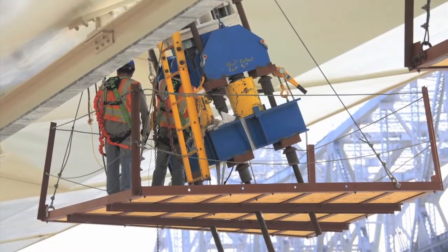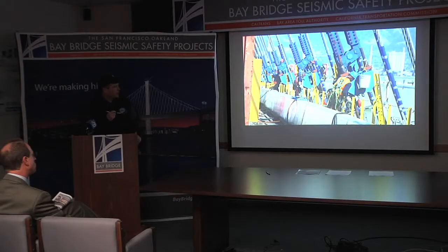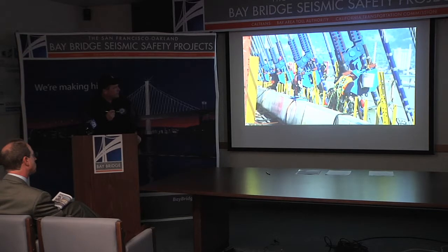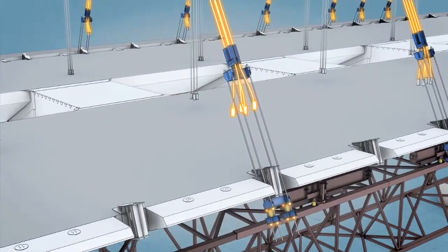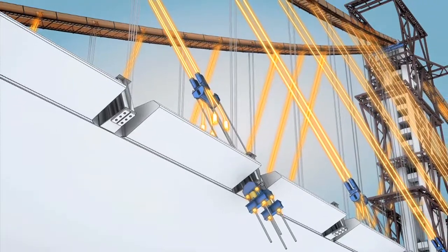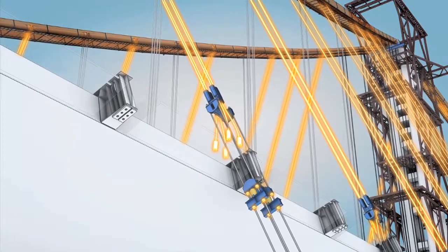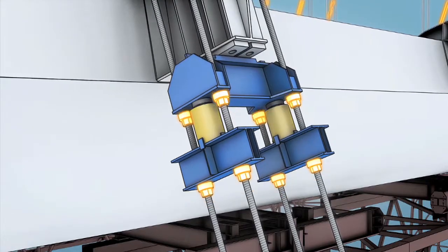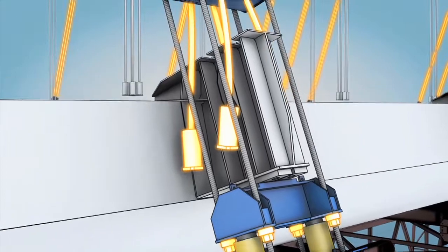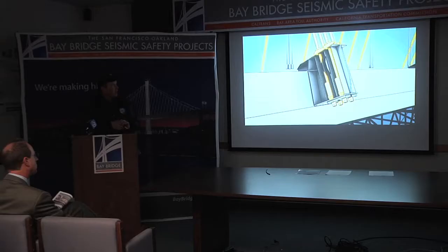Here's a little bit of what the site looked like. You can see all these platforms that were constructed above the bay, and you can see the ironworking team that was out there with our engineers at each one of these different locations. Now we're going to look at this again. The jacking unit right here is actually pulling down on the strands that are connected at this point. You can see that the cable is deforming up there as we're trying to get these pieces down into this anchor point where the suspenders actually connect onto the deck of the bridge itself. Then you can place the hardware on — nuts and bolts. You want simple construction hardware when you're dealing with something this big.